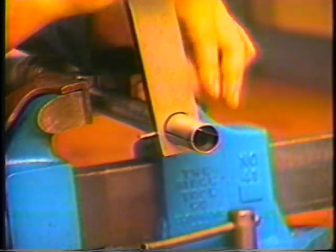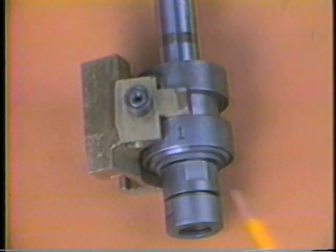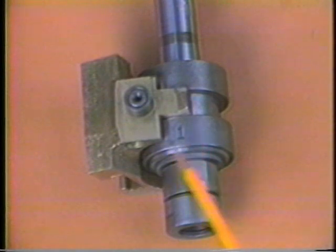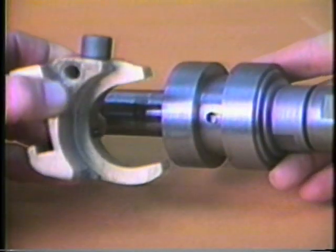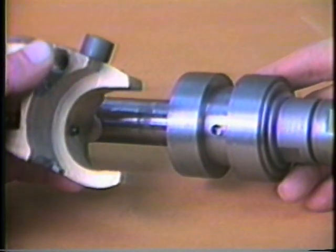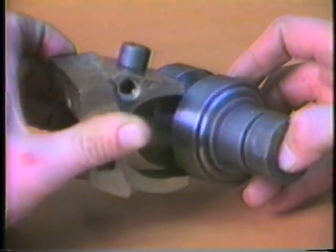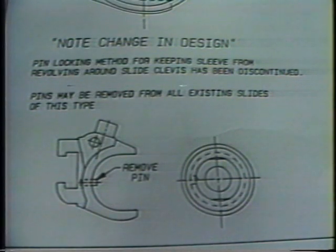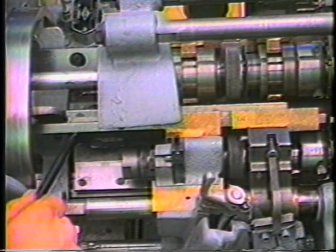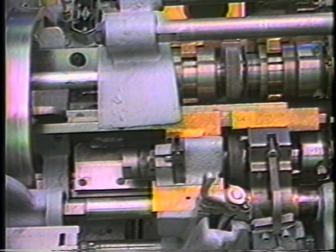The feed tubes are now ready for installation in the machine. Each feed tube outer sleeve is marked with a position number 1-5, and the mating feed slide is also marked. Assemble the mating feed slides and tube assemblies by sliding the feed slide into the slot on the feed tube outer sleeve. Please note a change in design: the pin locking method for keeping the sleeve from revolving around the slide clevis has been discontinued. Pins may be removed from all existing slides of this type. Each of the five chuck slides and the rails on the left slide bracket are also marked with a position number 1-5.